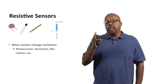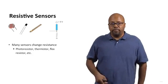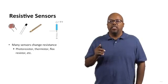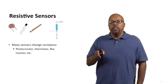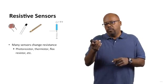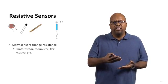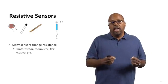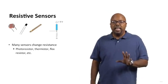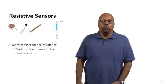Between the two resistors, you have that point connected to an Arduino pin. We're going to observe the voltage at that point, and that voltage will go up and down according to the resistance of that sensor. We'll have to wire that observation voltage into one of the analog pins — A0 through A5 — and then call analogRead to read the voltage. So that's the circuit we're going to build around the resistive sensor to be able to read it properly.